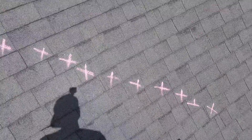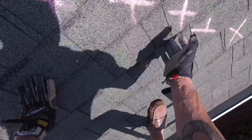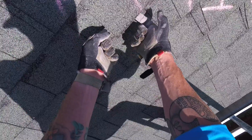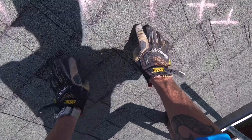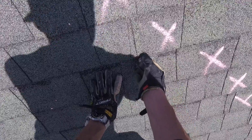The first thing I do when I get up on the roof is I start looking for what's called lift-up. And these guys right here are a perfect example — look how they're just kind of hanging on. Once you lose this bond on the back of the shingle that connects to the roof, it's not going to sit back down. It's just going to keep flopping around until it eventually breaks off.